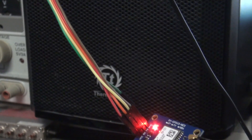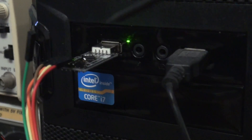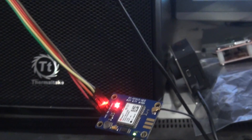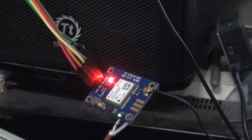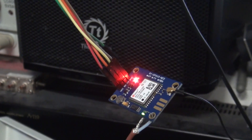So you just do that simple mod, connect it up to your UART, run your software, program it to whatever output frequency you want. In my case it was 13. You might want 12, or 15, or 5, depending on whatever built-in reference your counter has. You could set it to 10, which is standard for most proper test equipment. Then put it in a little box.